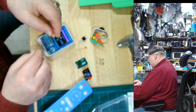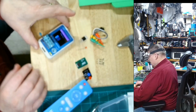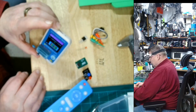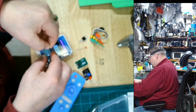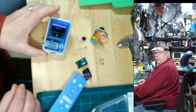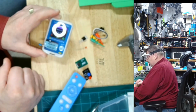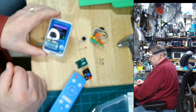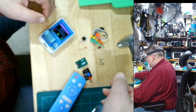So alright, let's go ahead and measure this capacitor. Let's see what it's gonna say. It didn't find. Oh, that's because I'm too far. Okay, I need to be in this leg here. Bing. And it finds capacitor 119.5 nanofarad. It's 120 basically. So that's working. And the LED we did earlier, that worked as well.